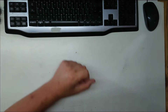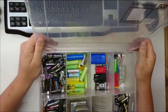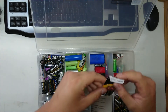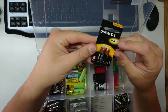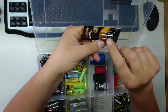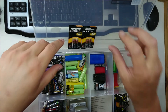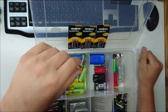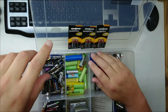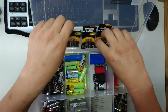Jump to the thing I prepared earlier — in here I have some batteries I found for about six bucks a pair. These are MN21s, which are very similar to the A23 batteries and in fact a compatible replacement. I managed to find six of these, and they should add up to 72 volts since they're 12 volts each. They're a stack of little tiny cells in a tube.